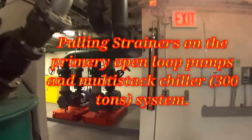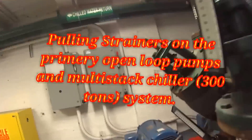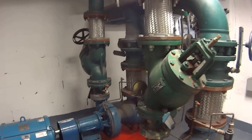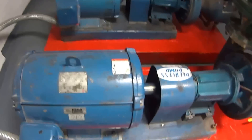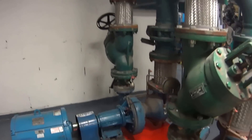I'm going to start up on this one right here. I need to make sure the other one is running before I shut this off, because if I shut these pumps off we'll have the entire chiller system down — we'd have no water for the condensers. So that one is running.